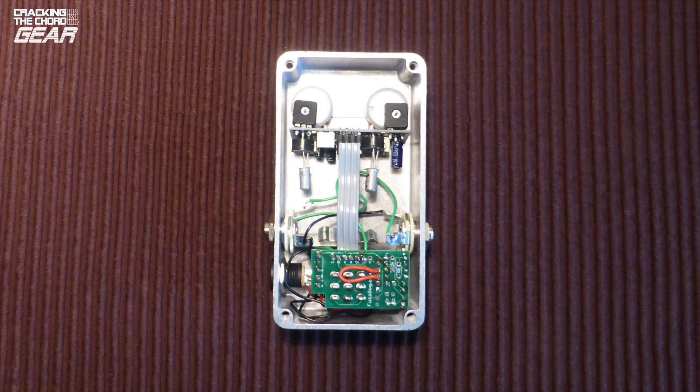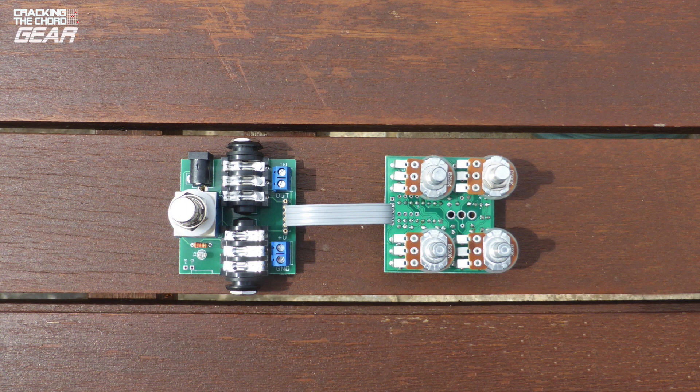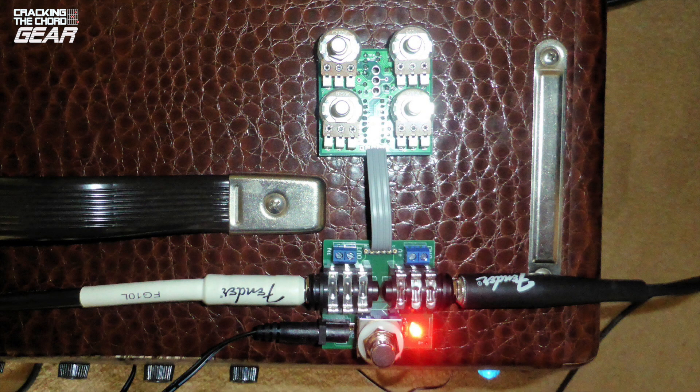As a condition of providing troubleshooting support, most kit providers will insist that you test the main board to ensure it works before assembling the pedal — that way you and they can confine fault finding to the main board. For a more tidy build the four-way ribbon connector and daughter board works well. But how do you test the board without soldering the ribbon cable and keeping things tidy? I recommend buying a board tester — Fuzzdog do one for only £10 and it will make life a lot easier if you're going to build a few pedals. The board tester has a built-in foot switch and connectors for power and audio. You just hook up the Direct Connect ribbon connector from the main board to the SIL socket on the tester and you can easily test the board. The Tonebender passed first time.